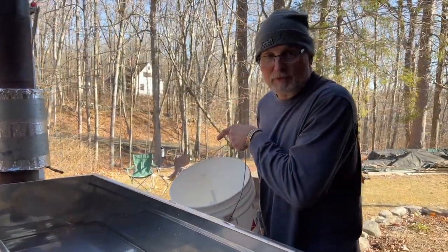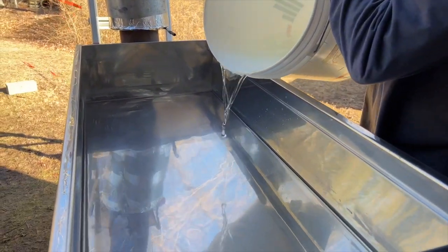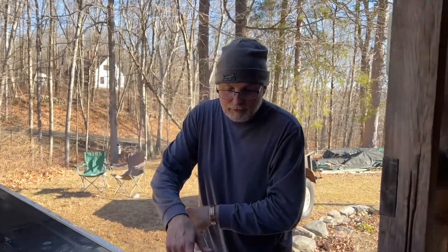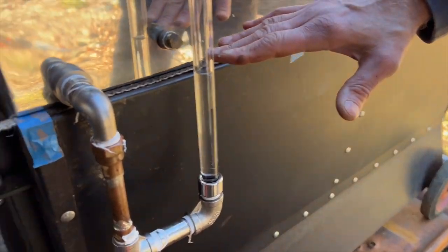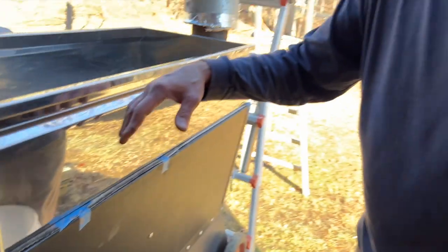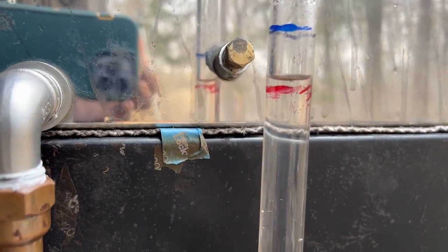We're filling up the pan for the first time, so what we do is we measure three gallons of sap. I've got my sight glass on this side, and once the sap levels off, I'm going to put a red line where three gallons is. As we boil, when it gets down to that red line, that means we've got to keep our eye on the pan. I'll have two lines set up — one's high and one's low. We're going to keep shooting for the middle and adjust our pre-warmer accordingly. This way we can add sap as fast as we evaporate it.